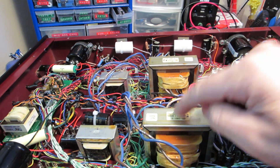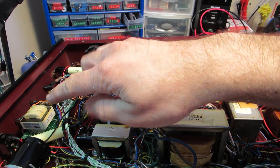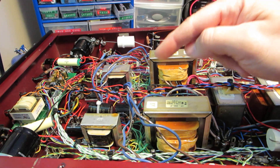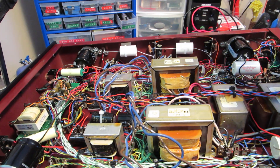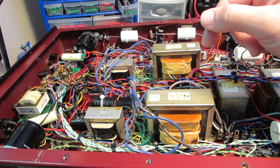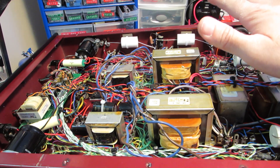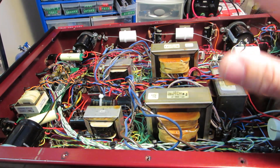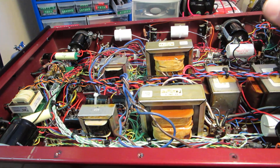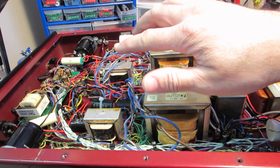Another thing: when I got it, it had a set of really crappy SovTek 12AX7s installed in the input position, and it ruined the sound of this thing. These need the right type of input tube — they're designed around the 12BZ7. I even found that a good set of Mullard 12AT7s actually sounded really good in the input position. But the 12AX7s that were thrown in there completely made this thing sound terrible — really flat, lifeless, no dynamics. If you experienced it that way, you'd think this thing's a piece of junk. So make sure it's got the right type and good quality input tubes, because they make all the difference in this thing.